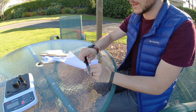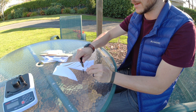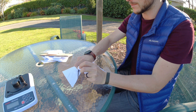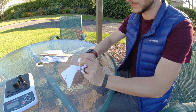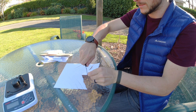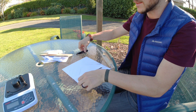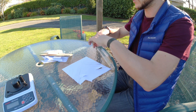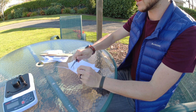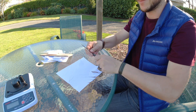That's the best working edge — smoothest slice on paper — on the 0.1 micron diamond film. It will draw cut pretty well, won't quite push cut. But that's approaching what most knife guys would consider a solid working edge. So there you go — best so far. Thanks for watching. Peace out.